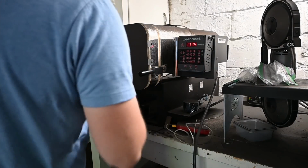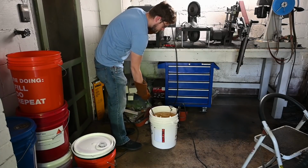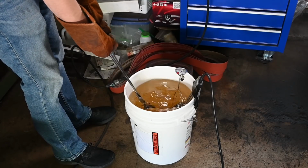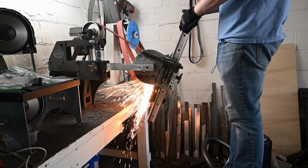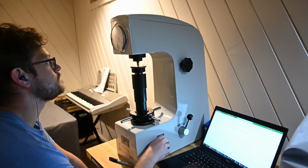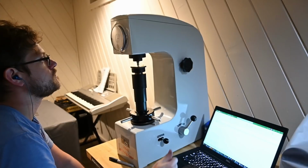So I took all of these steels, I measured them, and I cut them so that they're 1.5 inches wide and 2 inches long. I austenitized them at pretty generic temperatures for each steel. Then I quenched them in the oil, heated to between 120 and 150 degrees Fahrenheit. And then I ground away a 32nd of an inch to remove any decarb and measure the hardness, and then another 32nd of an inch and measured again, and so on until I reached the center, which was an 1/8 inch for the 1/4 inch material. And then I can measure both the performance of each oil with every steel and see how different steels compare to each other in terms of hardenability. Now, there can be some differences between different manufacturers because the structure may be coarser or finer as we receive it, and a coarser structure will actually have higher hardenability.